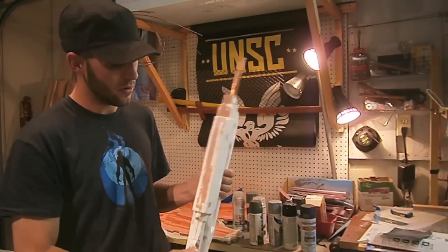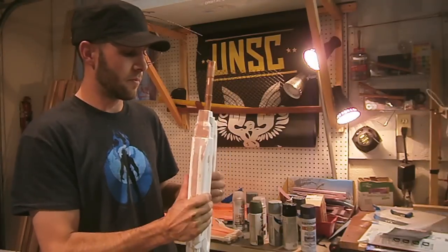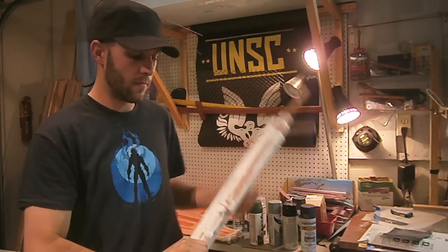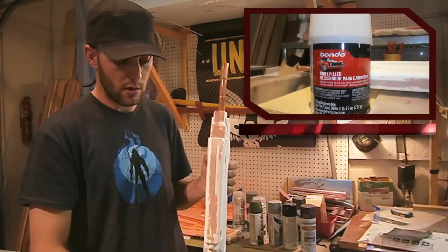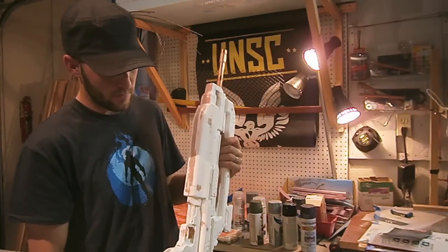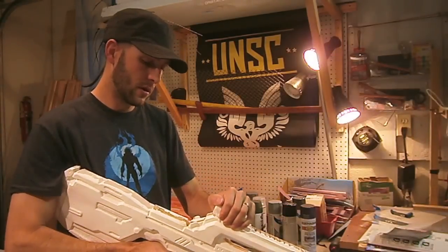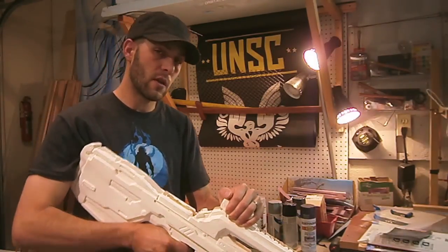It's got some edges that I had to seam together, where I wanted to take the two halves of my mold, cast them in plastic, and put them together. And then seam them together with this Bondo — nice smooth auto body liquid. It comes out really nice. I did that because in the future, if I cast this again in plastic, I can take the two halves and machine them.